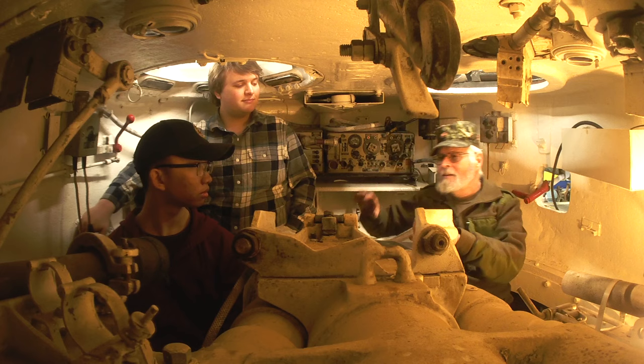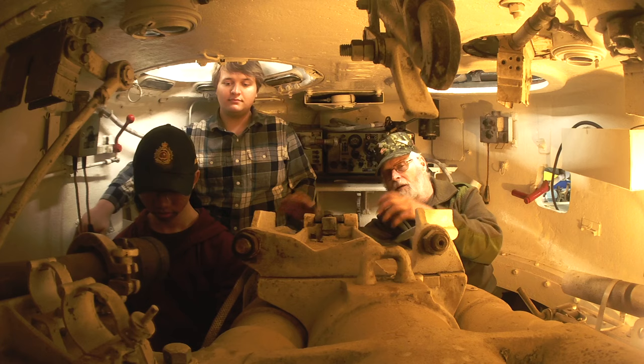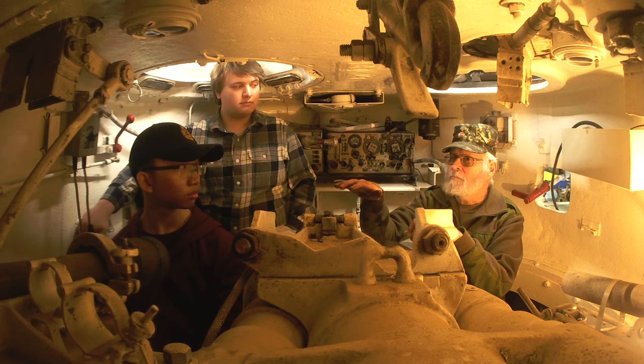Elevation and training. Down to your left is the red wheel with a knob on the side of it, and that is for elevation. It can actually be linked up to a gyro unit that's down underneath here, so that when the tank is moving, the gun's elevation will remain on target. Not like today's tanks, it does not have the traverse control system that will keep the gun on target even when the tank steers.